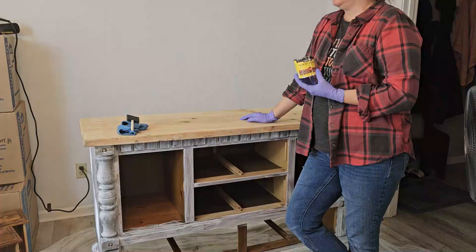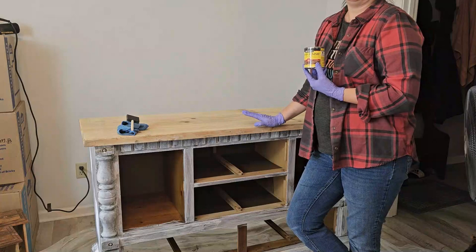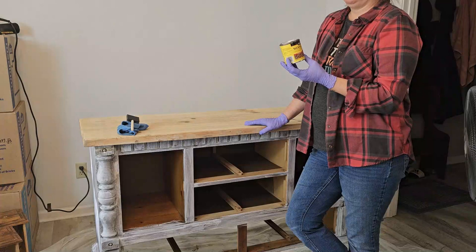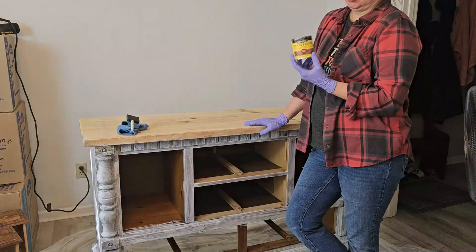I'm going to go ahead and stain the wood. I'm not going to use a pre-stain conditioner because I actually like the way it goes on without the pre-stain conditioner. But afterwards, I'm also going to go over with a whitewash once the stain has time to almost dry. So we'll get started, and fingers crossed, because I don't want to restrip this. The second restripping was a lot harder than the first. It was a lot stickier. So let's get started with this.